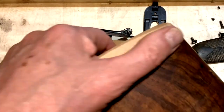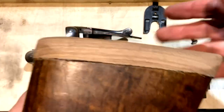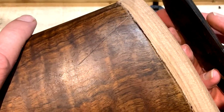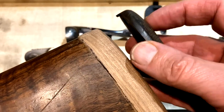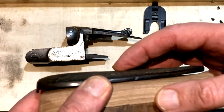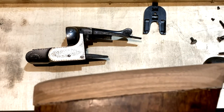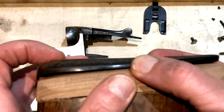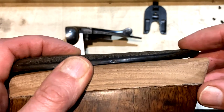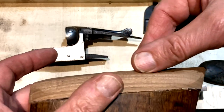Okay, some time has passed and I've chosen, in between jobs, in fact, to start the roughing process. As you can see, a taper needs to be made from top to bottom. So it tapers more towards the rear here. So this is presently too high. Hard to show you here as a progress report. There you go. I'll have to measure it with the verniers. So the height there versus the height there. It needs to flatten off a little bit across here.